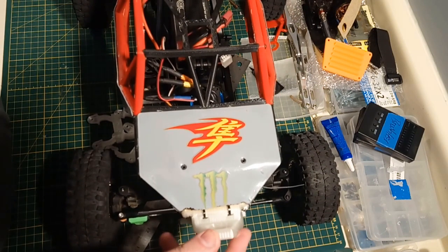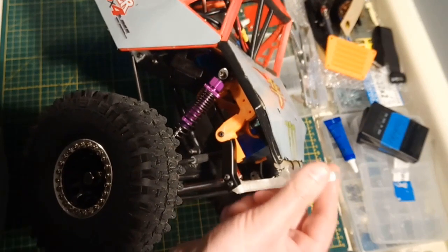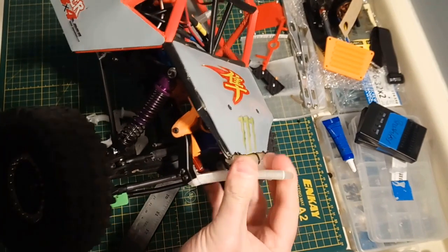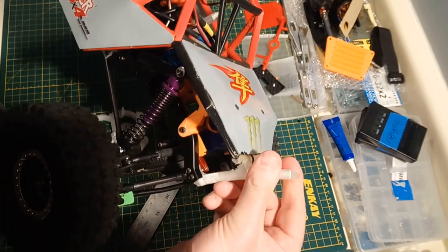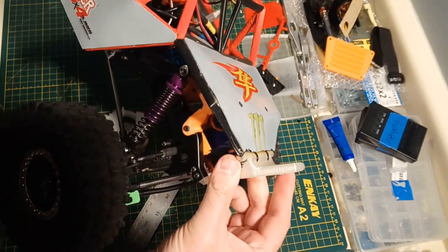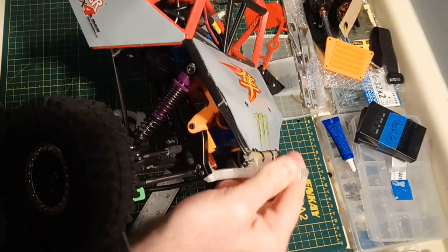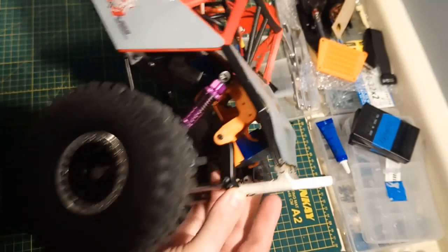There are some cures. This front bumper here is made of TPU — it's a very flexible plastic, as you can see it bends like crazy. It's really strong and durable. The problem is it's a little too flexible for a lot of parts. For something like a suspension arm, there's way too much flex — it moves way too much to be functional as a suspension arm.